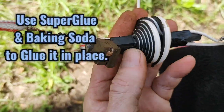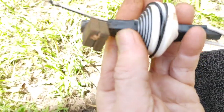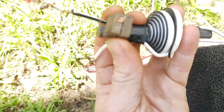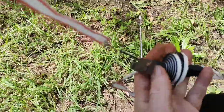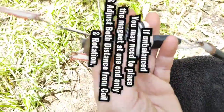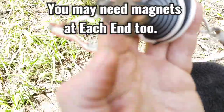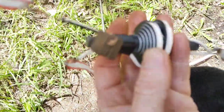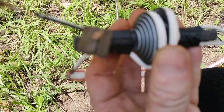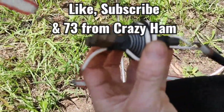Instead of using magnets, you could slide a ferrite core in and out to change the value, but I find it much more efficient using magnets — it takes a bit of fiddling to get the right range. Of course you change your element length too; if this wire lying on the ground were in the air, it would change its tune. If you go for full-size quarter-wave elements you won't need this at all. This is impedance matching the mismatch, and it's extremely efficient. Give it a go — 73 and thanks for watching.